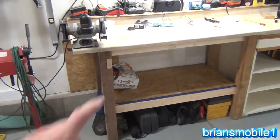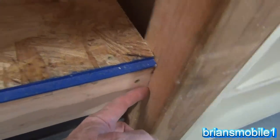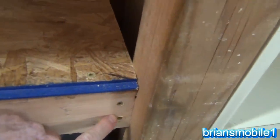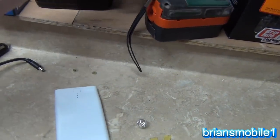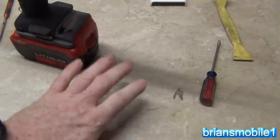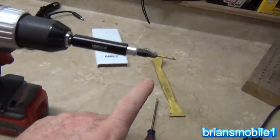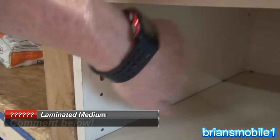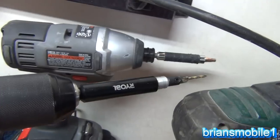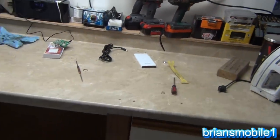Now if there are any improvements, I'll do them. I did glue in the joints and then screwed all of them. As far as the shelf in the bottom, these are cut in — you can see where this is cut in. It's supported really well across the front and the back. I just did a board from here to here. I discovered these cool new drill bits — they're probably not new, but it's new to me. I got this countersink — see, all of these are countersunk. Instead of using angle brackets, I decided to just use the long outdoor screws — three and a half inches. They're pretty hardcore, but you have to countersink to get them in there. Same thing with doing the screws through this material — whatever this processed, heavily man-made stuff is — I had to countersink. It's nice to have drills set up: that one's set up to drive screws, it's an impact driver; this one's set up to drill; then I've got another one set up with a Phillips. Having three of them running really helped this come along faster.